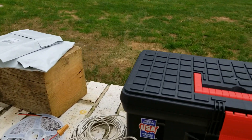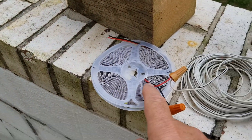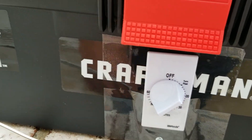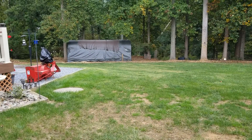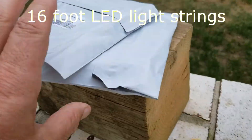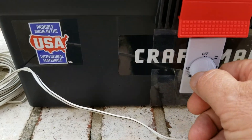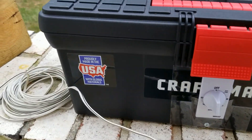When I walk into the shed I want to run my LED lights, and I've got a wire coming out of the toolbox for that. To turn them on I've put a rotary timer switch that you can set to run and then automatically shut off. The lights don't look very bright in the daytime, but at nighttime in a shed they're very useful. I'm going to hook up two other strings inside the shed as well, so after a while the timer will automatically turn off and shut off the lights to preserve power.